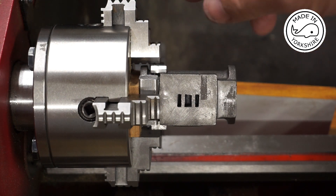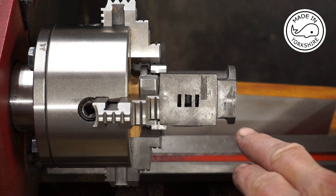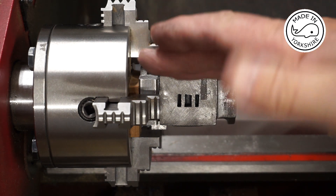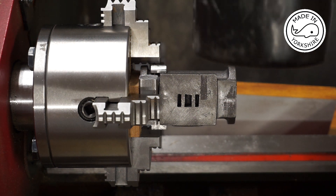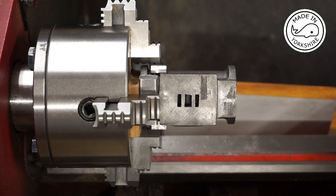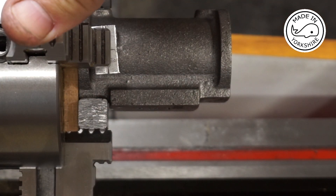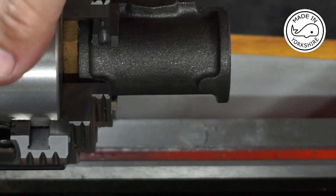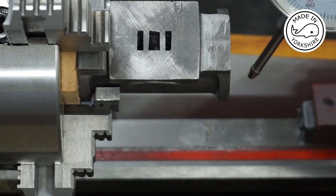The way I've gone about setting this up is I've got it roughly centred on the edge with the gauge. It's quite important that the edges of this cylinder are parallel with the bed, because you could have it at an angle, put a gauge on it, and still have it centred on the edge. So the way I've done this is I've used a mallet just to tap the edges and eyeballed the edge against the bed.